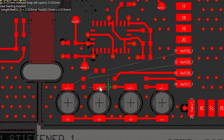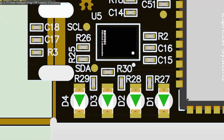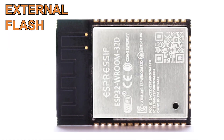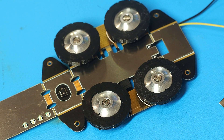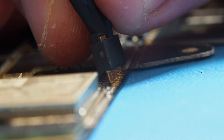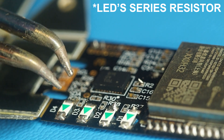The ESP32 will also handle the onboard LiPo battery recharger, proximity sensor, and inertial measurement unit. It also lights up four LEDs. We have a little problem because only two LEDs are lighting up — I connected these LEDs to the nearest pin available without checking if they can be used as output. In fact, these specific two pins are used to communicate with the external flash chip onboard the module, so using them as outputs is definitely a no-go.